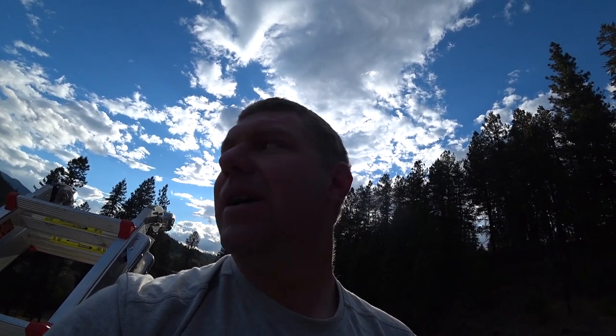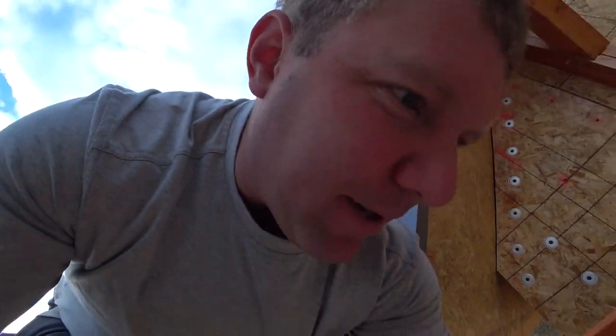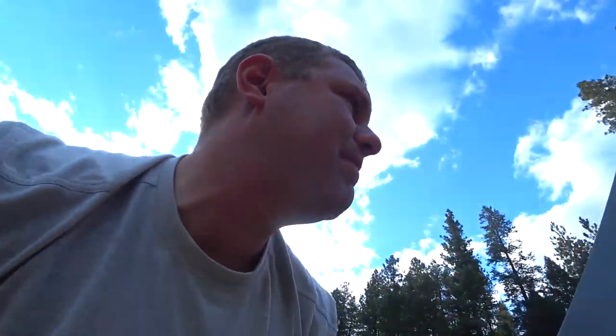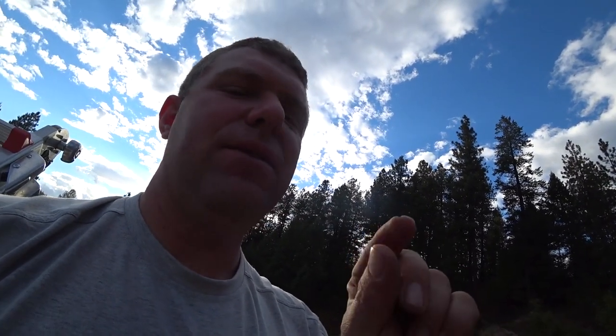Guys, huge progress. First of all, I was able to get one full section done. One man progress. Had to work through some of the kinks and make sense of where the cleat goes, but I see a perpetual problem. This cleat material is a joke. The bend on the cleat doesn't even remotely match the bend on the metal. Unlike the offset cleat, which was an inch deep, this is only 3/8 of an inch deep. And basically, in handling the cleat, it just gets all boogered up.